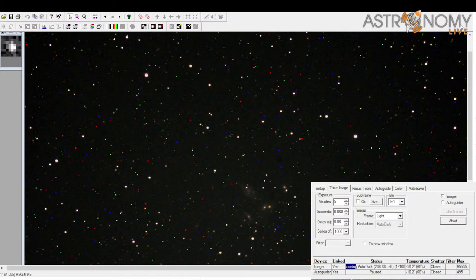Now, some of this noise signal comes from hot pixels, these red, green, and blue pixels you see here. These very intense colors indicate that a single pixel that was filtered for red, green, or blue light is providing a false on sort of signal. We call that a hot pixel. And it looks really red, green, or blue because when the image was processed to be converted into a color picture, that pixel was known to be filtered for red, green, or blue light, and none of the neighboring pixels received any light of that, at least at that intensity. And so it shows up as a very bright color. But that's not a real signal, that's just a defective pixel.